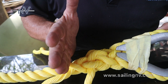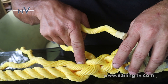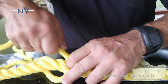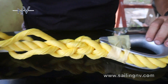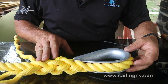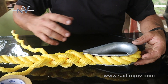You can see these two are on the same level. Now the last one — the strand has to pass from the top to the next one, below the second one. We open the second one and we pass below. And now is the moment to redistribute the torsion of the strand and distribute the tension. You can see the splice starting to appear. This is one splice with three passages. The three passages is the minimum for making one splice — it's not the strongest, but two passages is not enough. When you pull the thimble, the splice opens by itself.